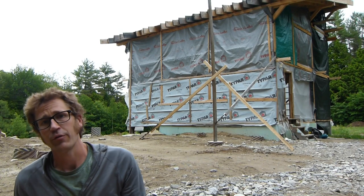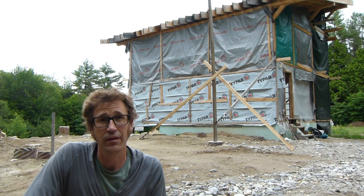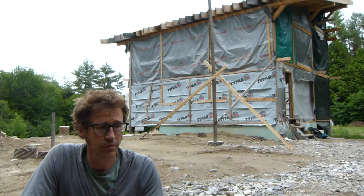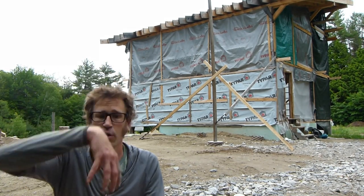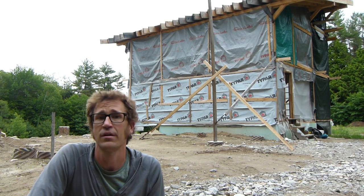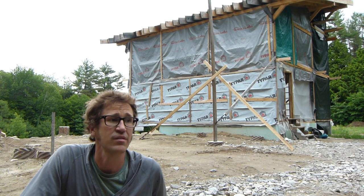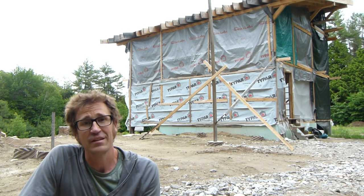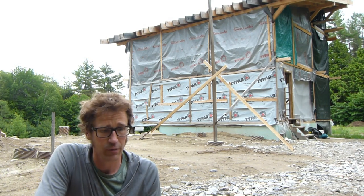So I've got the height of the post for the portico figured out. And the next step is going to be finding the center of the piers so I can drill a little hole into the concrete and sink a little piece of scrap rebar so the posts can sit down on top of that. So when I bump into them with the tractor or the car or the motorcycle, they don't go sailing off into the hinterlands and collapsing the entire garage.